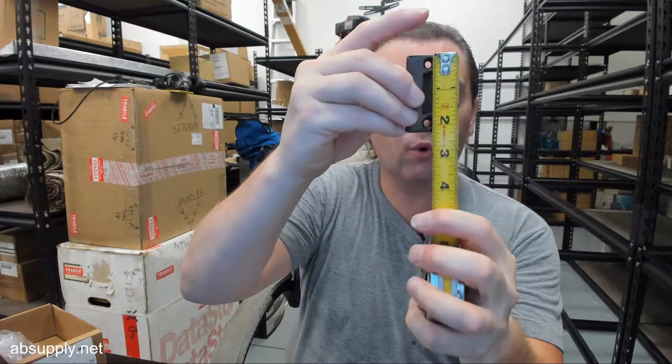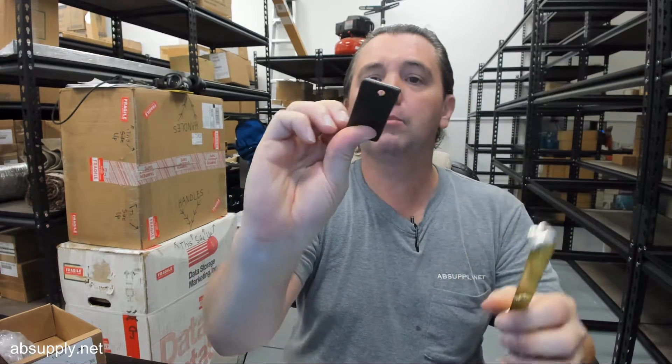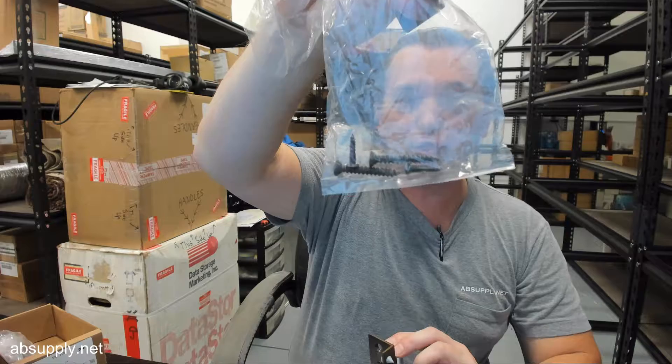All of them from Rockwood are going to incorporate the body prep and then the plate prep — a two-step process — and it's easy material, certainly once you get started with doing it. Overall length of the strike: 2¼ inches. Overall width: 1⅛ inch, bronze finish. This material is going to be made of solid brass, or at least the finished components are, with that oil rubbed finish. You're going to get screws for installing everything — the long ones are for your roller latch, the shorter ones will be for your strike plate.